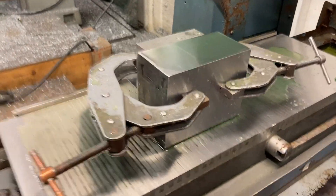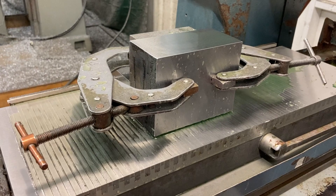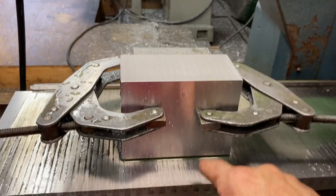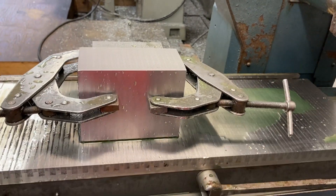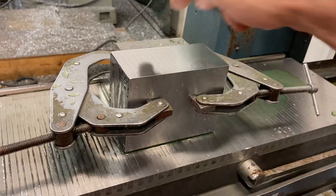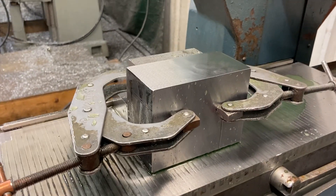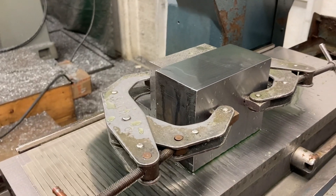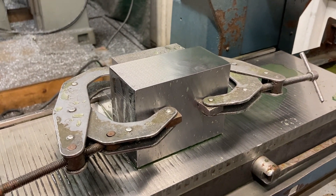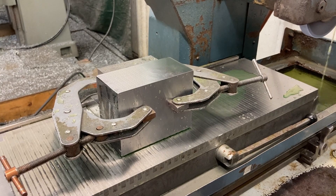Two thousandths and this surface cleaned up — pretty square to start with. When we do the other side, we take the shim out, take the knee off, no more clamps needed. We just bank that surface right on the chuck and grind it to the finished dimension. The net block will be square — these sides parallel to each other and perpendicular to this surface, and these sides also parallel within less than half a thousandth probably. I'm not trying to split tenths — if I'm within one and the surface finishes look fantastic, that's more than necessary. Titan Machine Tool signing off. Thanks for watching, please subscribe if you liked the video.